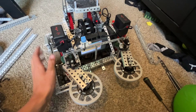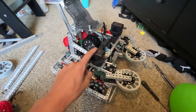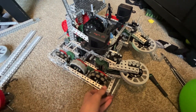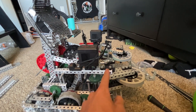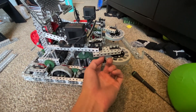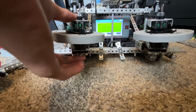We'll start at the front with the intake. These are going to be 5.5 watt motors — we just don't have access to them yet, we have them ordered but they haven't arrived, so they're 11 watts for now. Right now this robot has nine motors, or 99 watts worth of motors. The intake is very simple: it's got a little gear train to move the motor further back into the robot, and it's got two chains — one here and one under this piece of c-channel — just for extra security in case one chain breaks.